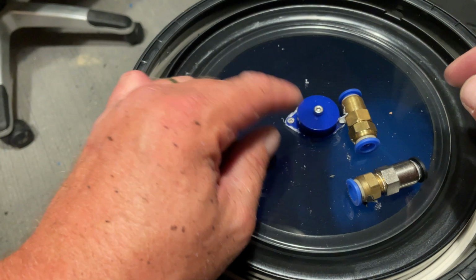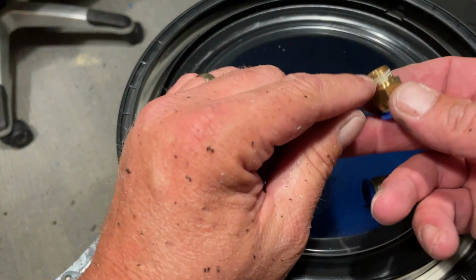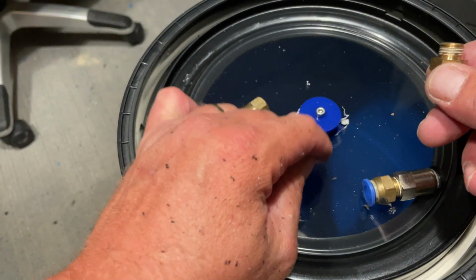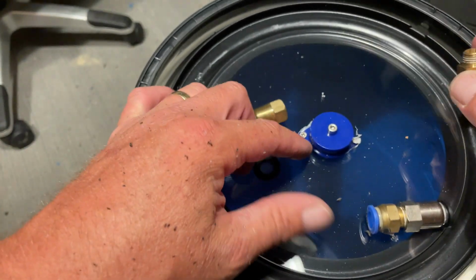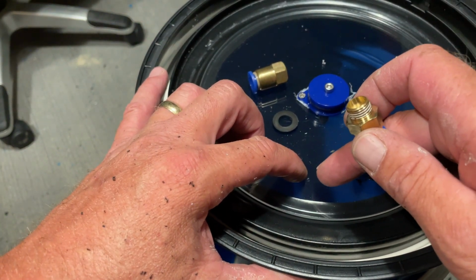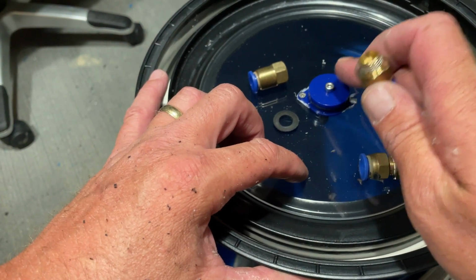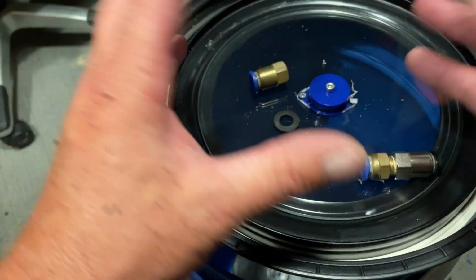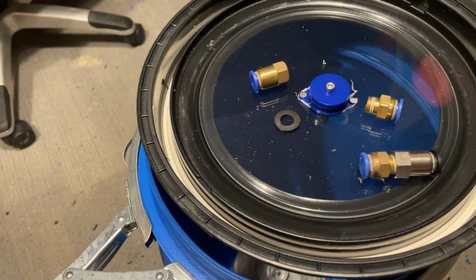Right, so I'll get my vernier calipers. I'll measure that male thread and drill a hole inside this. I'm going to go for a side measurement, a side penetration, and I'll put an elbow on the bottom of the airline to marry up with the center of the barrel, which should then give me a mushroom effect from the middle working out for my rotation. So I'll go and grab that bit and drill that hole.